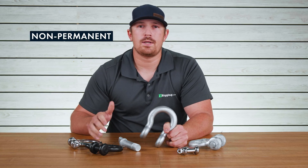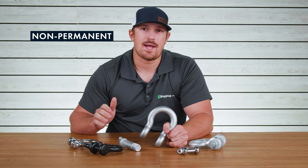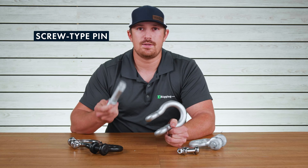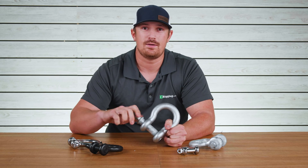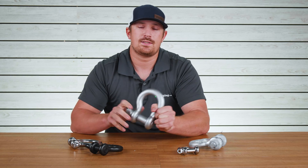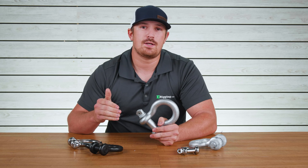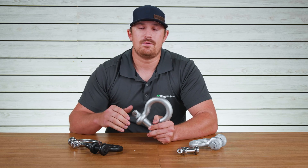For non-permanent types of rigging applications, I would recommend selecting a shackle that has a screw pin method of securement. This pin is threaded at one end, passes through the ears of your shackle, and threads into the ear on the opposite side — it's a friction fit, so when you tighten that pin down it's locked into place. The only real downside of screw type pins is that if there's a lot of vibration in the rigging assembly, that pin can potentially wiggle its way out and you might even lose the pin.